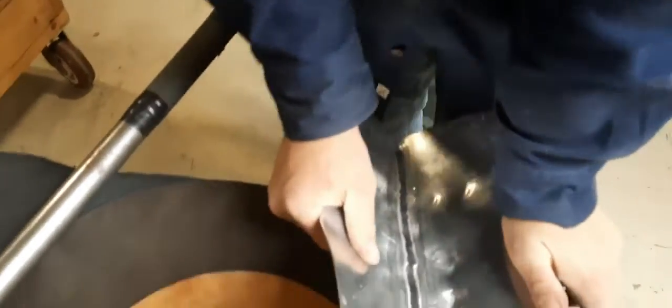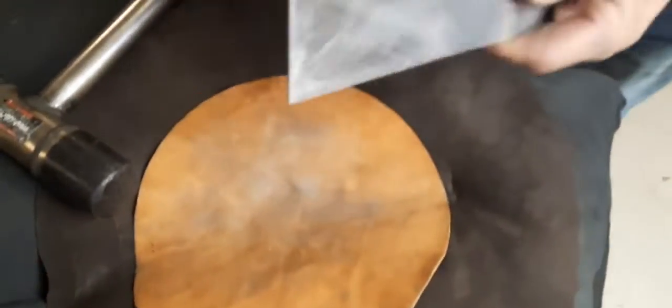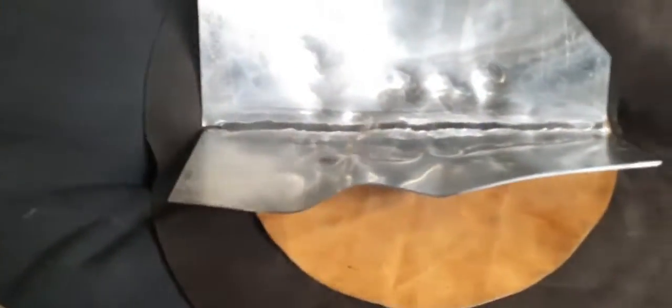That's a heavy hammer. And he's done a bunch of successful welds — he's on about his fifth or sixth. He's had a few cracks. You get cracks when you stick the tungsten into the puddle, or you boil it and get it too hot. All kinds of little potential problems. So he's getting really good after six hours.